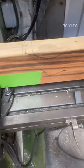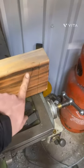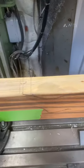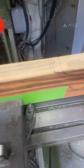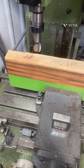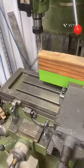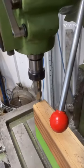The unfinished width of the stock is 50mm. The comb and cheek piece side is where I want the width, and this has been machined flat, so I'm going to machine through the centre using that as my centre line. I'll have to take a little bit off each side, but I can set it up on the bandsaw fence and rip through a couple of mil to get it where I want. It's all a learning curve since I'm not a chippy - I'm a metal monkey. The centre line is trued up and square, so time to start machining.